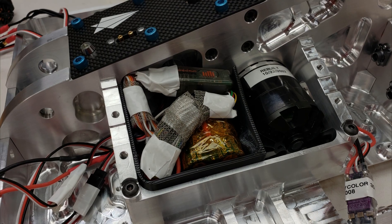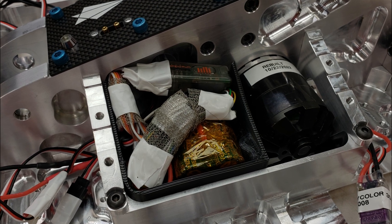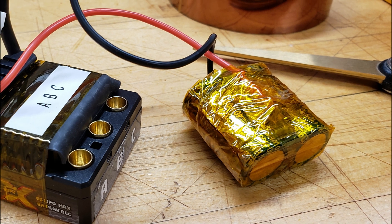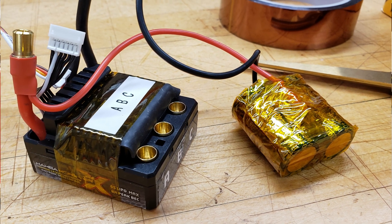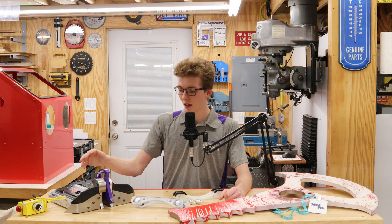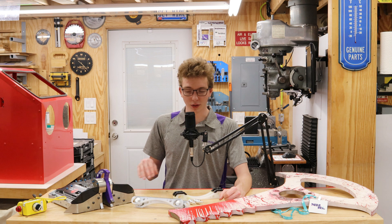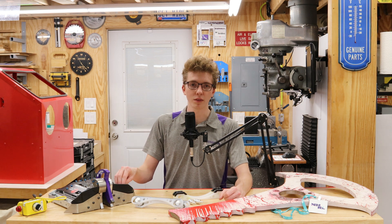Underneath the covers, the weapon motor, weapon ESC, batteries, and electronics that power the system are all the same as last time. We did add two massive capacitors to the weapon ESC to help reduce ripple current, because that was causing us damage on the weapon ESC in the past. This time we didn't run into any issues, and our voltage ripple was very flat during the whole event. That's going to be something that we're recommending other people do and on our own bots moving forward to help retain these weapon ESCs.